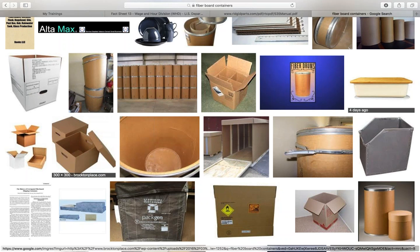Not only that, but also we want to stack them by length as well. So preferably keep them separated by length, but if we're going to stack them by length, of course, keep them neatly and orderly, and you'll probably have your longer pieces on the bottom. But normally, remember this, we're normally using longer pieces first. So if you have the longer pieces on the bottom, you're often moving a lot of the small, shorter pieces on a more regular basis, okay? So that's why it's almost better to stack them separately.